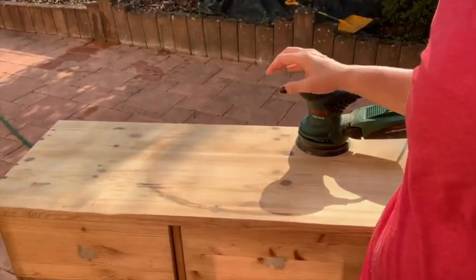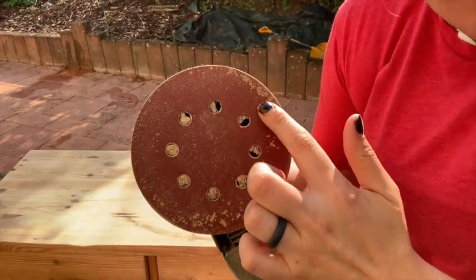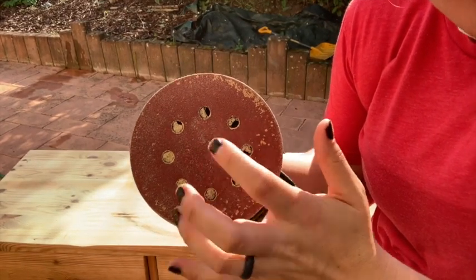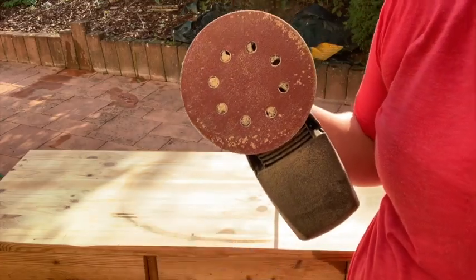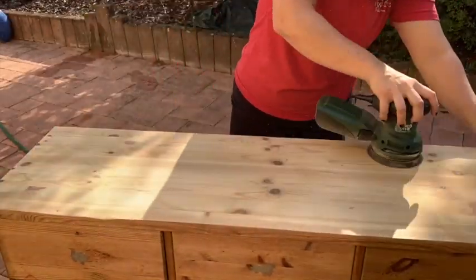For this next part, I've sanded down the entire thing but we still have a couple of spots right here. I'm going to change the pad — you can see there's a little bit of build-up — and stick with the 80 grit to go over this piece one more time. I used two pads of 80 grit, and now I'm going to switch out and do a 120 grit pass to smooth things out and get any last-minute imperfections.